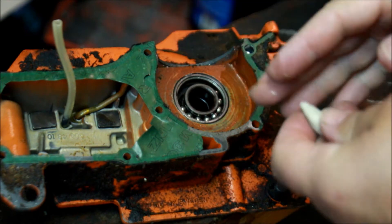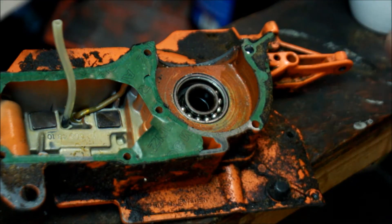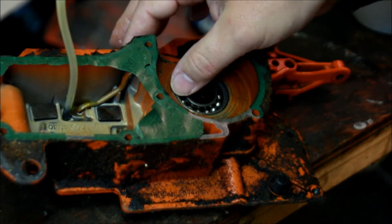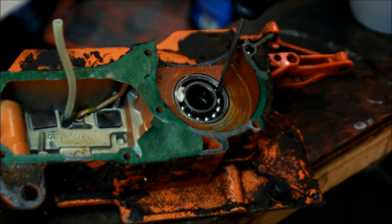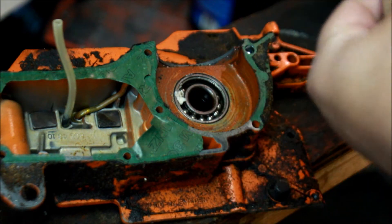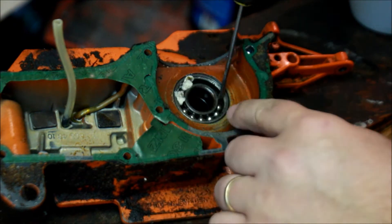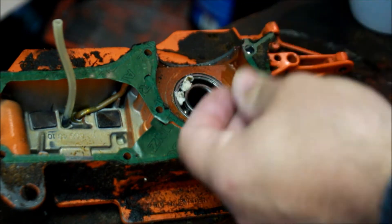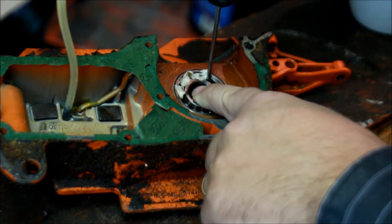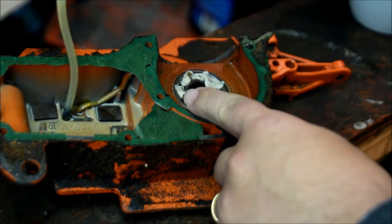All we need to do is hold the bearings equidistant. And even if you were shy some bearings — if they'd fallen out or whatever — you have to hold the bearings equidistant, more or less, around the thing so it grabs. Let's put a little bit of plumber's putty. Bring the bearing around. Squish it on in. Bring another bearing around. So you're effectively creating a cage here with plumber's putty.